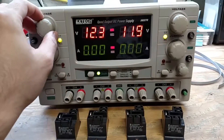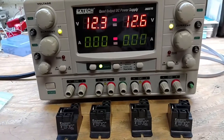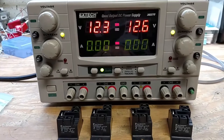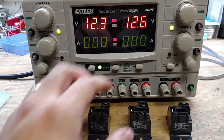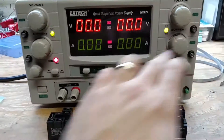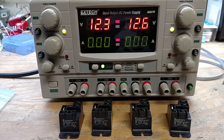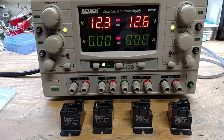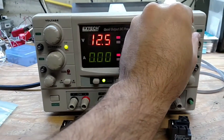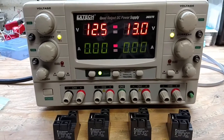Say you've adjusted this for 12 volts and you're powering some op-amps that are bipolar, and you've connected the supplies together to be a plus or minus 12 volt supply — it would be really annoying to have to make all your adjustments, click the output off, enable the outputs, and then enable each one. You want to power both rails simultaneously. You don't want to bring up just one rail because that can cause SCR latch-up and all kinds of issues. So this lets you make your adjustments and then just click once to turn them all on, and vice versa to turn them all off.